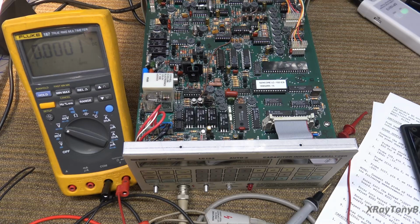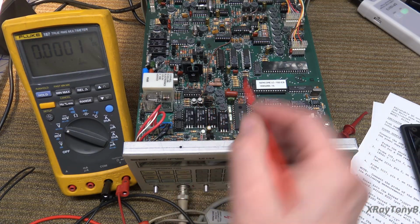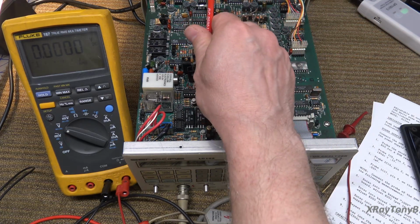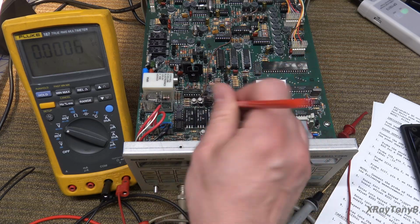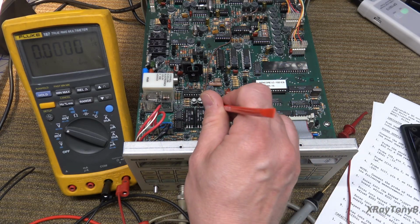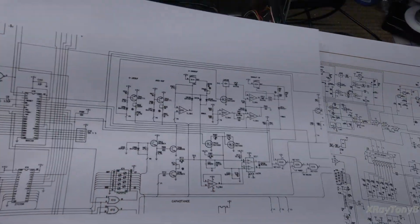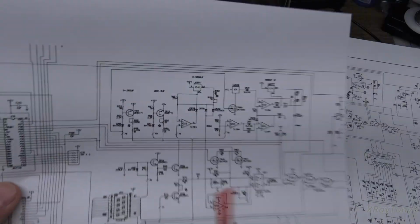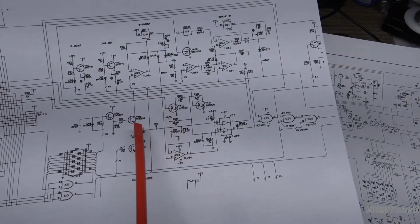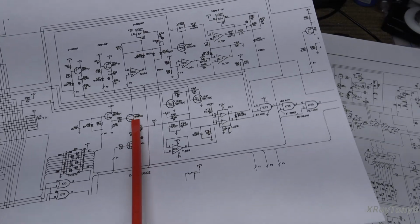Okay, this is a really strange transistor because the base is the middle pin. So it goes emitter, base, collector. Normally the base is on one of the ends and the collector is the center pin, center tab. Alright, so I zoomed in on this a little bit and printed it out so that Mr. Magoo can see what he's looking at. And again, coming down to this 2N6559, this is kind of a strange transistor.